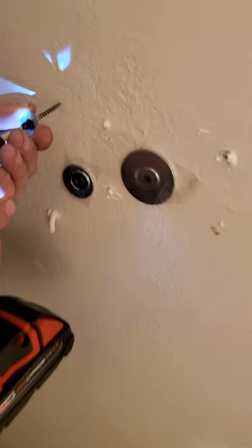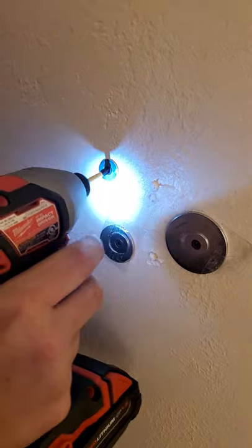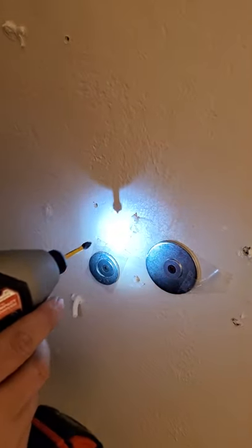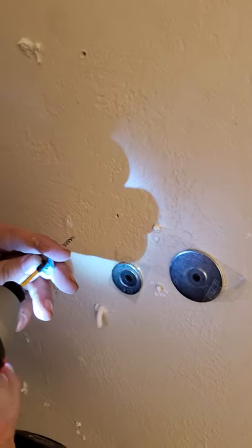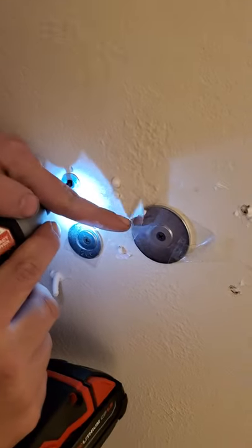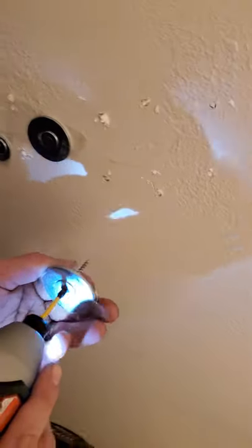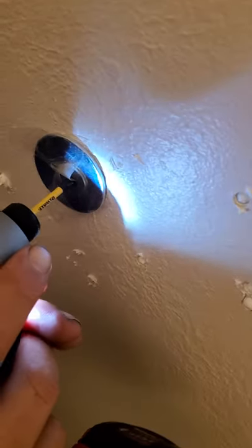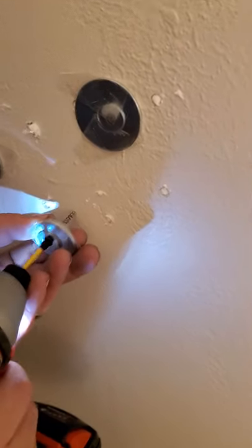You don't want to go too tight, but you want that proper amount of squish because that's important. And I have even super small washers because, frankly, I missed the lath — that's okay, that'll be part 12 of the series. Obviously that's one of the spots I went too high, so let's go down low. There's the lath! And we can see it squishing out right here. We don't want to go too tight because we don't want to strip it out. We're going to progressively pull all of the plaster and lath back using different size washers depending on where we're at.